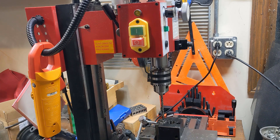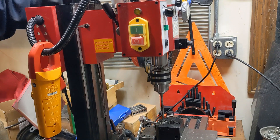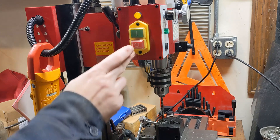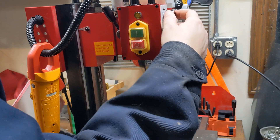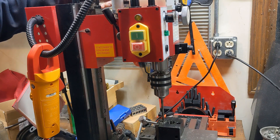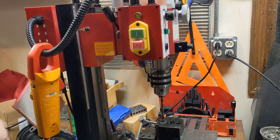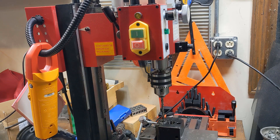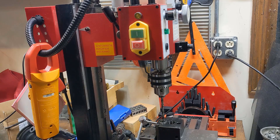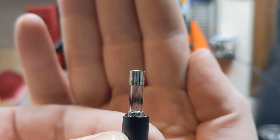At any rate, let's see if this is any better. Moving another eighth - try it again. Maybe? Didn't feel much different. So it worked a couple of times, and now it's not working again. This thing is very, very suspect. I moved that pot now about three-eighths of a turn, and it's blown the fuse. Now, they could be completely unrelated, but that's what's happened. I'm going to see if I can find one of these fuses - it is a fast five-amp 250-volt.